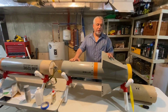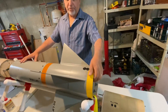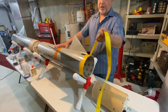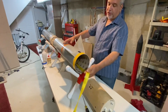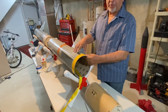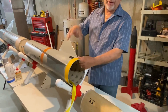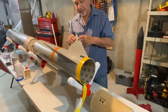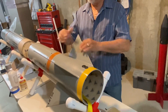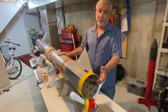When completed, this will be 155 inches long — slightly bigger than a full-scale AMRAAM. There's also an extra tube wrap here serving two purposes: first, when the rocket comes apart there's a lot of pressure on the tubes, so to prevent cracking or splitting I put an extra tube here to strengthen the upper piece so it doesn't shred. Second, this gives the fins a slot to fit into for extra strength so they don't break off.